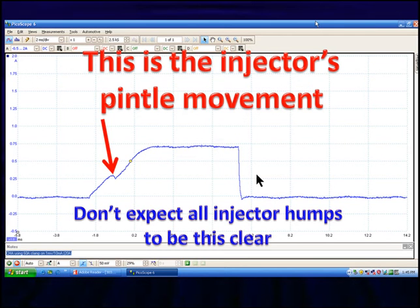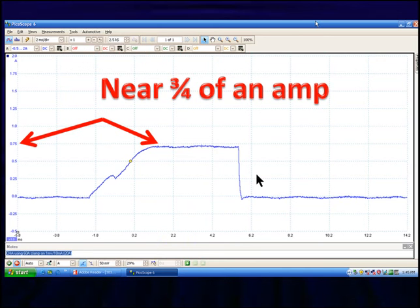We don't find it very often — it's once in a blue moon — but that doesn't mean we stop looking for it. The next important thing we're looking for is current flow. My spec here is near three-quarters of an amp, 750 milliamps. Looking at the reading on the left, you can see it reads 0.75 amps — right on spec.